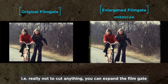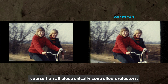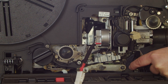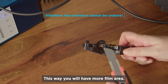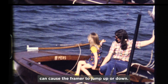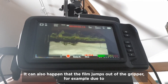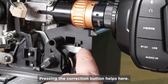To get a proper over-scan — really not cutting anything — you can expand the film gate yourself on all electronically controlled projectors. First turn off the power, then select the leftmost switch position to carefully remove the film gate. You can remove the small cover frame with a cutter. During the transfer, bad splices can cause the framer to jump up or down; correct the offset with the original framer knob of the projector. It can also happen that the film jumps out of the gripper due to perforation damage, which can be heard and seen immediately — pressing the correction button helps here.